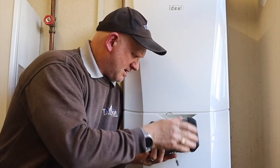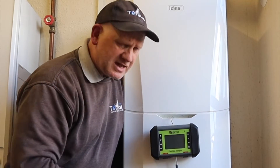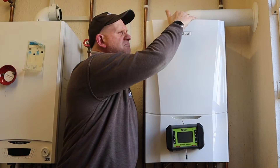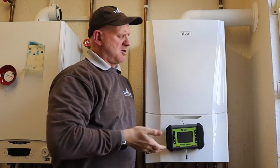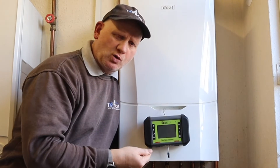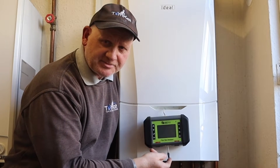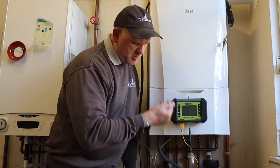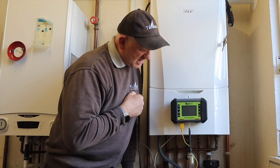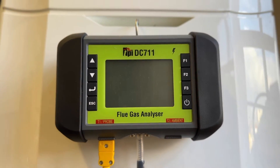What I'm going to do is use the hook and hook it on the front of the boiler casing just like that, so you can see what's going on. First thing I'm going to do is connect the probe to it, which connects onto here. Now you can see I've connected the probe to the return valve, and the K-probe to the T1 connector here. So turning it on is incredibly simple — we just press and hold this button here.